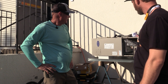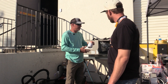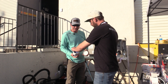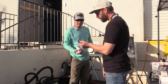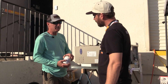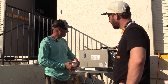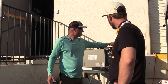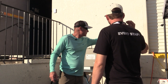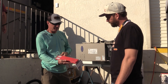And then the Assurety line — this Flow Plus, I really like. It has a waxy tab and they last. A lot of tablets fall apart pretty quick, in hours. And this stays in there for a while. You've got to treat your drains; on new installs we'll put some drain treatment in there. I like these as well — those last forever. You can lay one of those right in the front drain pan.